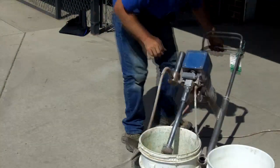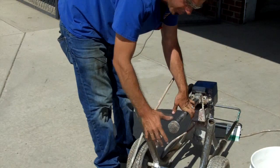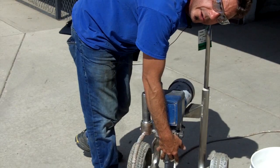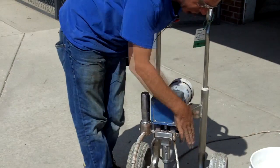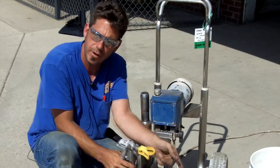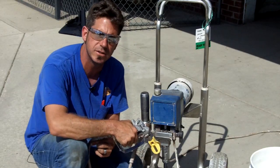I'm going to lean this machine back onto its back. I can move this bucket off the foot and out of the way, and I'm going to bring my five-gallon latex or oil-based paint bucket right underneath here. This tube will now go into your paint bucket — or oil bucket, whatever you're spraying — and that will help as an agitator as you work. Again, we're coming down on our pressure to make sure we have all pressure off this system before I think about grabbing that gun again.